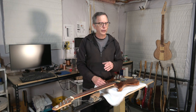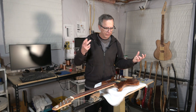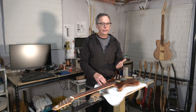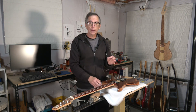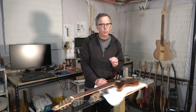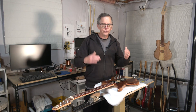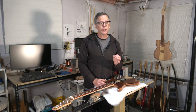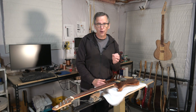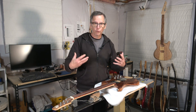The same might happen with burl wood. In certain situations, burl wood can actually be placed into a vacuum chamber with acrylic and then stabilized. What you get out of that is a consistent hardness and density, which might work really well for a fretboard. I've never used it myself, but if I was going to, that's probably the route I would go. However, that type of wood for a fretboard — I'm not sure how easy it is to source. So the short answer is yes, you can use burl, but you need to make sure it's consistent in its hardness and density throughout its length, either naturally or through artificial means.